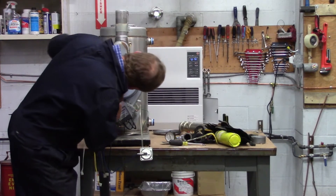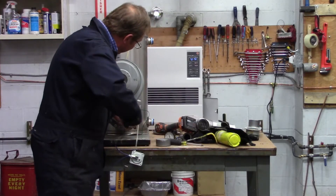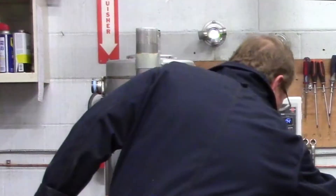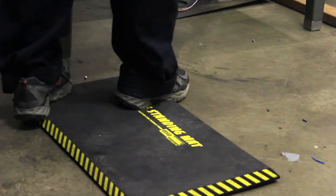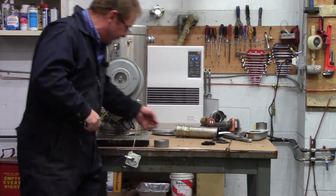The next thing I'm going to do is pull the burner. I'm going to start out by pulling these three screws out right here. Then I'm going to get down inside here — I have three large hex heads down here next. Then I'm going to come up above and pull this piece off next. Using a standing mat or a kneeling mat like this will help you out and give you much more longevity in your career.